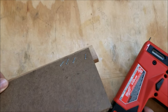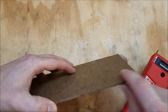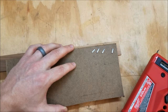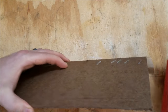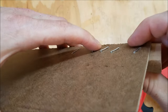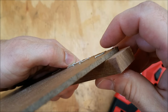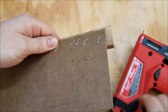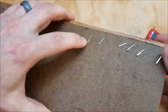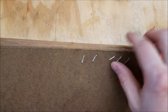I've got some hardboard and some walnut here. I'm going to test tacking hardboard to hardwood — I use hardboard for backings on dressers sometimes, and I like to staple it because you can pull the staples out a lot easier than brads. These are half-inch staples. You can see there's a little bit of deflection in the legs, and I had two that aren't flush because I had the back end up off the table. But the rest show no gaps between the hardboard, hardwood, and staple — no mangled staples like I've seen with other staple guns on this application. You just have to have a solid surface to staple against.